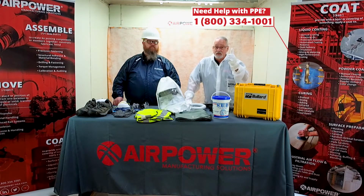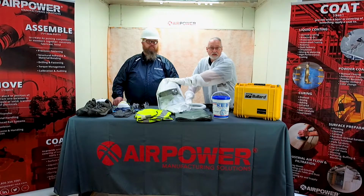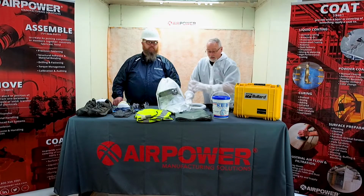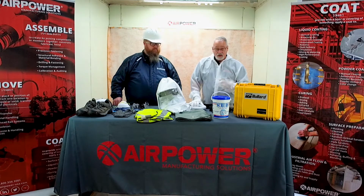It utilizes particulate and moisture coalescing to take the oils out from your compressor, and a charcoal filter to take the taste and the odor out. It also has a carbon monoxide monitor, so that if someone parks a forklift or a vehicle near your compressor, it will sense that, it will alarm, you will stop what you're doing, and you won't be harmed by that. Another thing that goes along with this is a couple of things that are important for that, right?